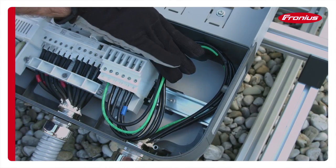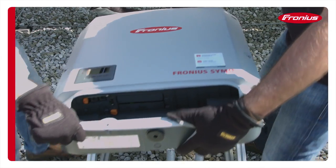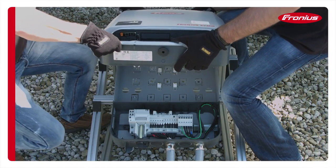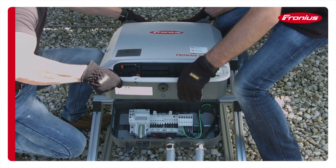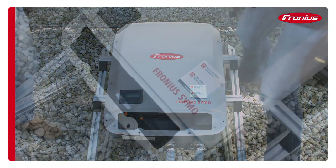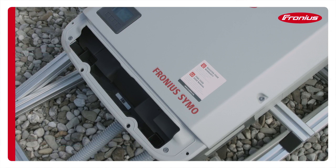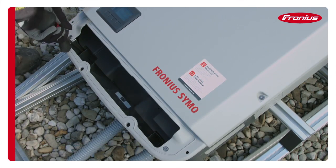Make sure that there is nothing that will prevent the inverter from swinging and mating with the mounting bracket. Take special care that your conductors or communication wires do not prevent or block the inverter from closing and properly seating to the mounting bracket. Tighten down both securing screws using your adjustable torque driver set to 1.8 foot-pounds.